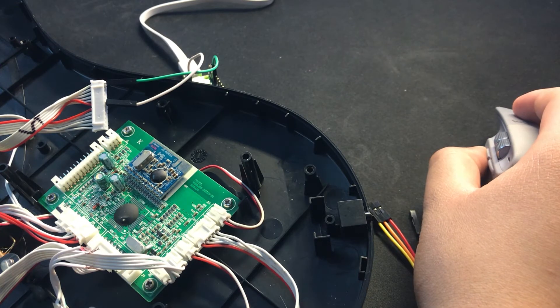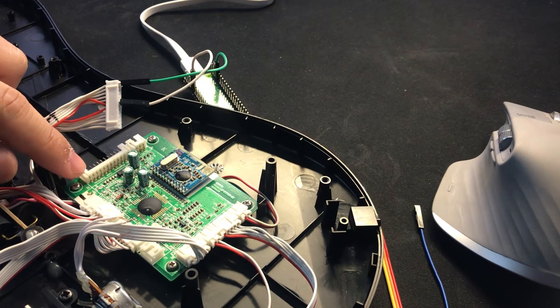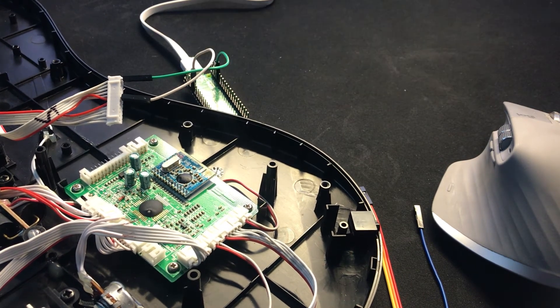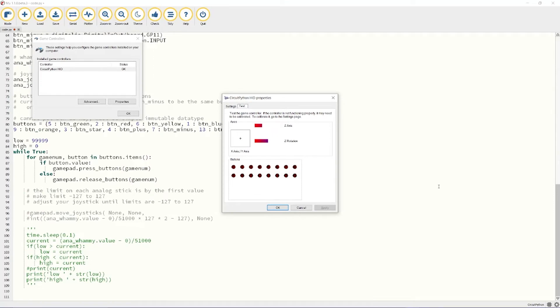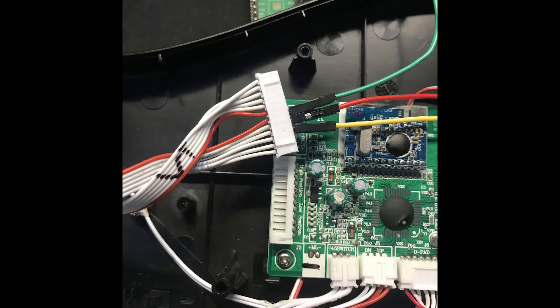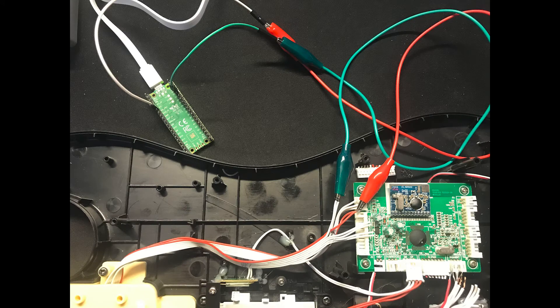Let's move on to the frets. If you want to do the mechanical fret mod, I'll link the tutorial in the description, but we're not doing that because the Stratocaster frets are fine for me. The frets at the top are labeled high position and the bottom are called low position. To test out which button is which, I've connected the button for green to the far wire and the voltage in to the red wire. After pressing the green fret button on the guitar, we see button 5 flash on the game controller settings. Use this way of testing for the plus, minus, and strum bar. This is my test for using both high and low frets on the same button.